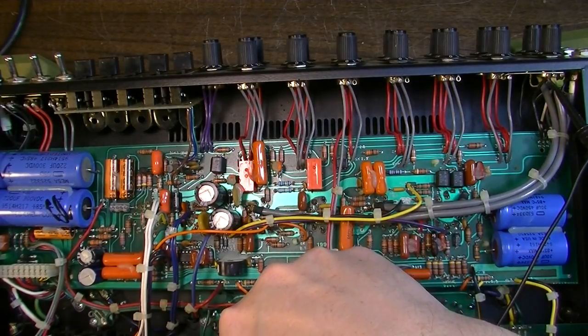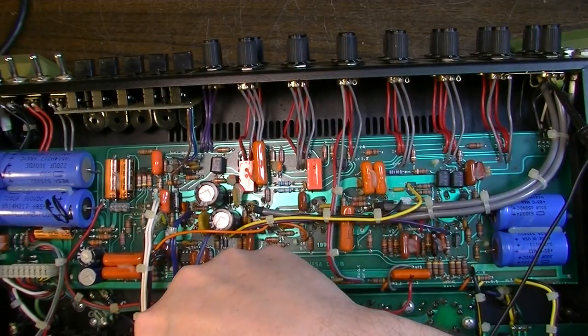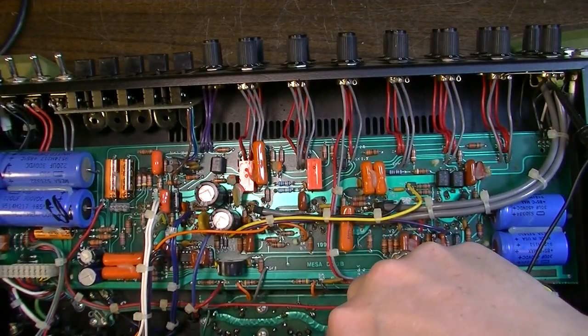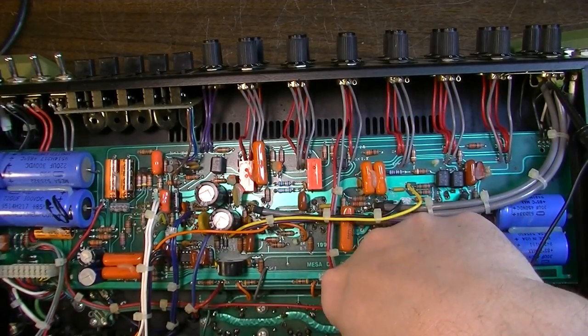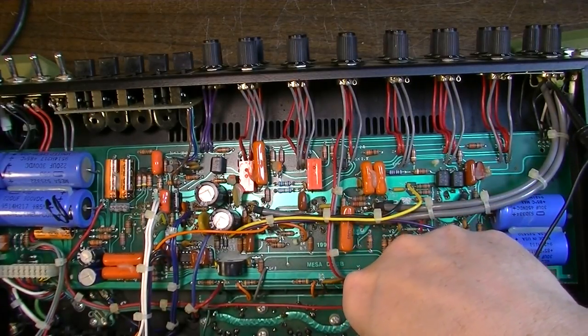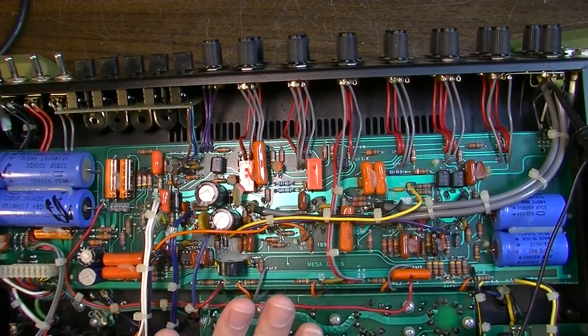Negative 11.5 volts on the grid there, negative 11.5 on the grid there, negative 11.5 on the grid there, and negative 11.5 on the grid there. So that's close to what the schematic calls for. I still don't see any red plating on the tubes. They do smell hot, but they seem just hot from being over them. But that's EL84s for you too.